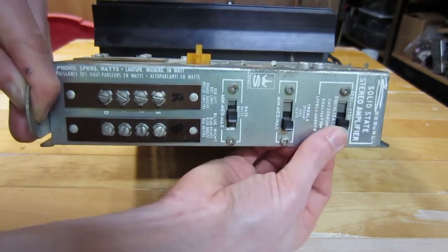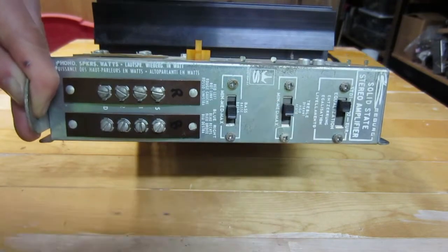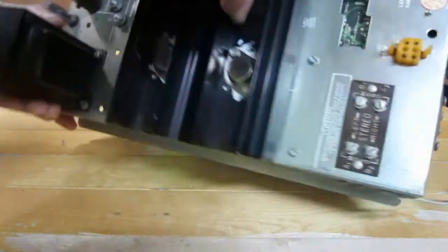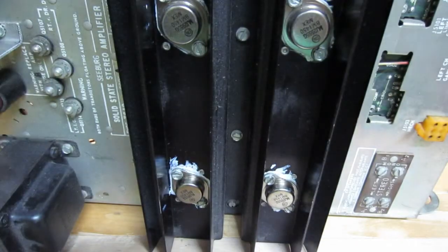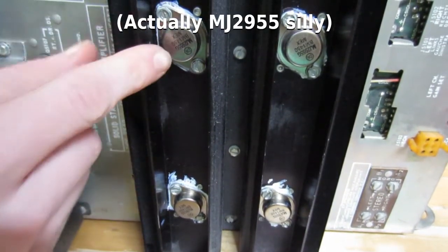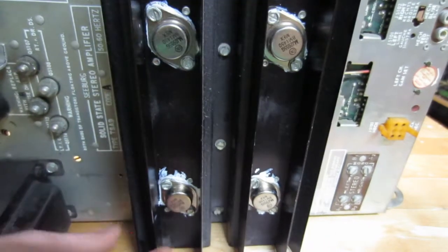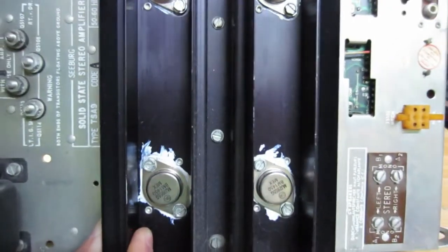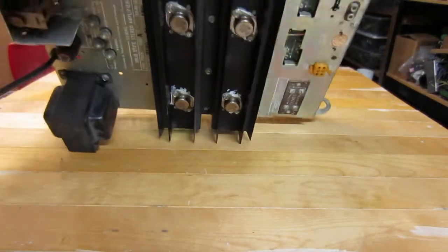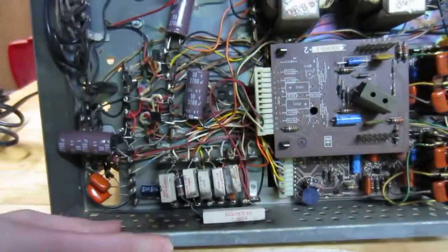These should all be clean and move freely. As you might be able to tell, the original germanium output transistors have been replaced. The new output transistors are 2N2955, which are PNP type power transistors made by Onsemi in this case. Although these are much more reliable and easier to find, the circuit requires modifications in order to make them work, and we will be getting into that in a moment.